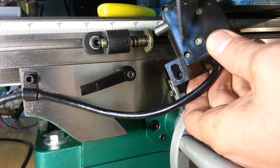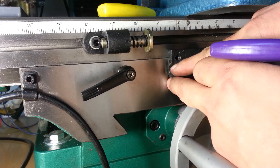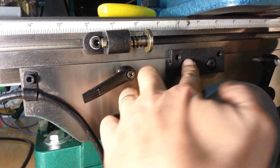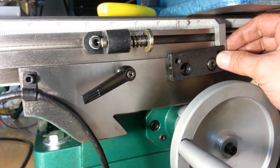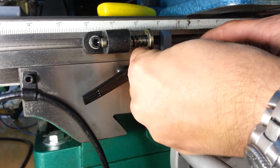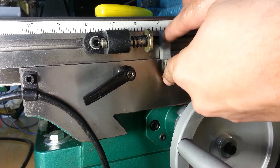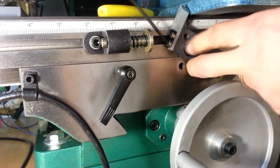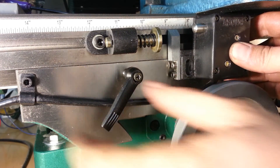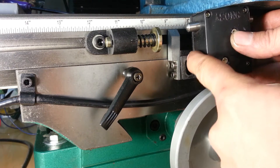It's not a great solution, but this part is just a switch — all it has to do is not fall off the machine. I'll take the pointer off and figure out how far we need to machine it. Since we flipped this piece over, these threads used to be over here on the opposite corner. Actually, if we just leave it in the same orientation it should fit in those same screw holes, and this way it goes right to the bottom of the number — it's almost better this way and we don't have to make any milling modifications. The next part just needs to go a little bit lower so that these contact each other nicely, clears the wheel, and clears the vise. We're going to cut off the very top part of this bracket so the screw will go all the way up to the top.